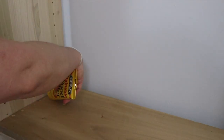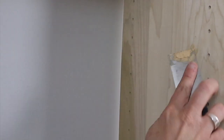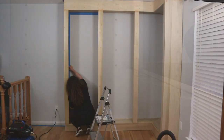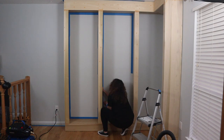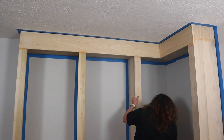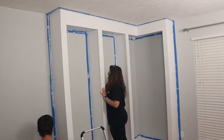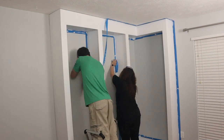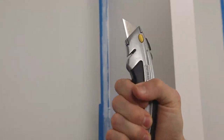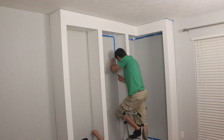Then it was time to paint. Before you get started with the actual paint, you'll definitely want to fill in all of the nail holes using some wood filler, as well as the screw holes where you screwed in the units. Make sure to let this dry and sand it before you paint it. Also, make sure you tape against the wall unless you're planning on painting the wall the same color. We wanted the wall to stay gray and the unit to be white, so we taped all around it — top, bottoms, and insides — and then two coats later, the unit was done. One tip when removing tape after painting: ensure the paint isn't stuck to the tape. Have a utility knife on hand and cut any areas that look bonded together, otherwise you'll end up pulling up a lot more than tape.